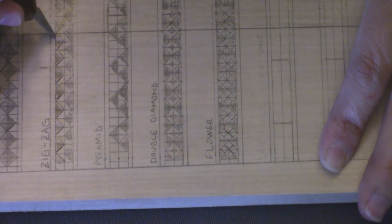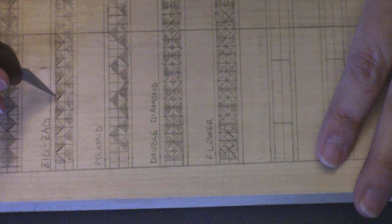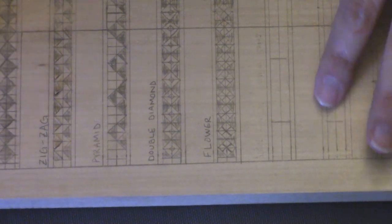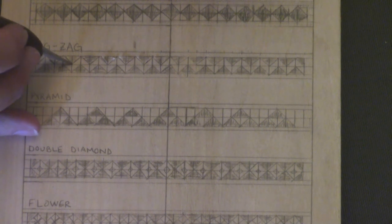And that's okay. It's important not to take your knife and try to pry those chips out, because what will end up happening is that you're going to have an unclean pop, and it may pull out extra material. So what I like to do a lot of times is kind of feel around and feel where that fiber is still connected. I'll start from the beginning, and I'll go and retrace my steps. And a lot of times, it'll pop out.